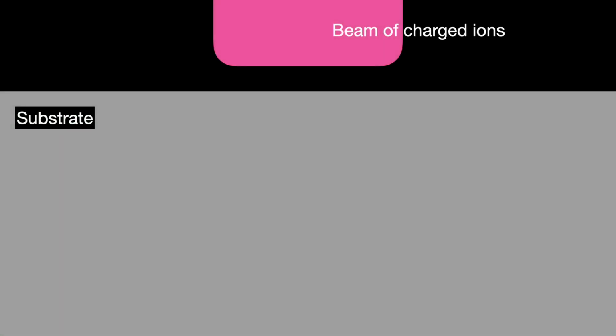Let's imagine a flat substrate of silicon. Then we fire a high-density plasma mix of etchant and ions down at it. This is just the same as reactive ion etching. The ions physically bombard the silicon while the etchant chemically reacts with it. The etchant gets to work. Because it is chemical, it is isotropic, eating in all directions. This creates a little round crater.